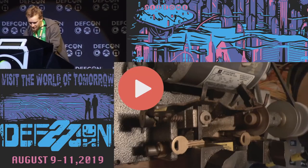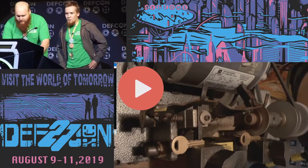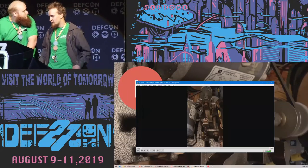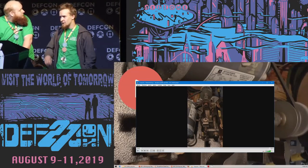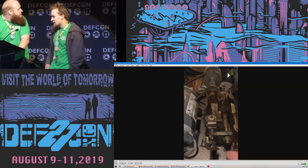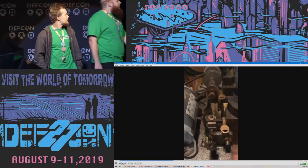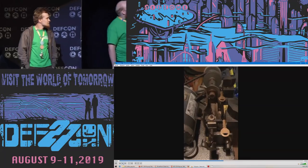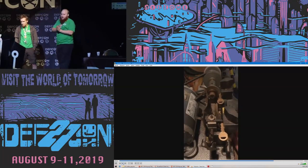showing you, we're going to be showing you a video, if you can get that up. What this machine here is called is a profile cutter, and essentially how it works is it has a little probe that rides along the key that you want copied, and then a cutter on the right side that you can see here. That's what actually cuts the bidding in the key. You can see there on the bottom is the probe following the key, and on the top is the cutter, and that's going to create the exact same profile on the duplicate.